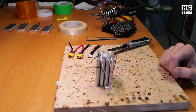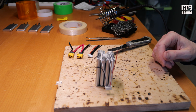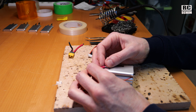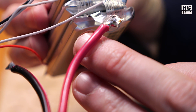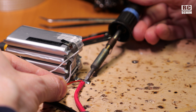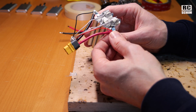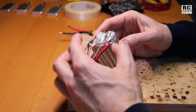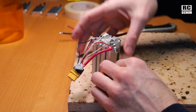Of course you only see after a few cycles if the cells are really of good quality or if you have to exchange one. I think they should be quite good quality — because DJI — but who knows. Make sure you also connect the main plus and minus, and you want to have some cable tension relief system in place. This looks like a really good connection — that's how you want the bonding of the solder to be, and it's the correct pole as well. The most important thing is to pre-tin everything; it makes life so much easier. Now I have plus and minus connected, so I'll just use enough tape to hold them in place.